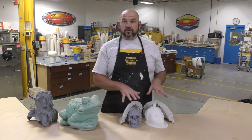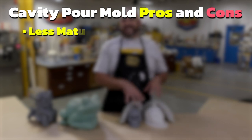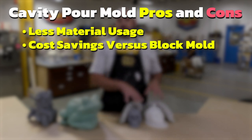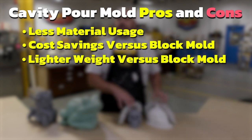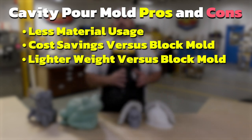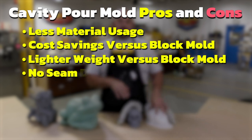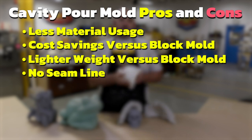Now, some of the pros for a cavity pour mold is the fact that it does use less material than a block mold would. Therefore, the cost savings versus a block mold is great. It's much lighter than a block mold would be because the amount of molding material that we're using is something really important to consider when working on medium sized or even larger molds. As well as there's no seam line in the mold itself, which lends itself to making glove molds or sock molds.